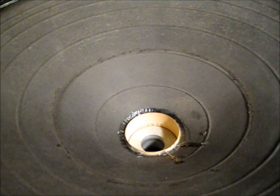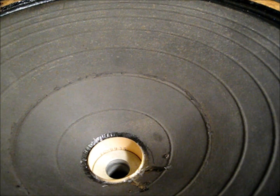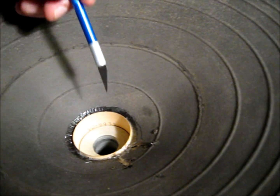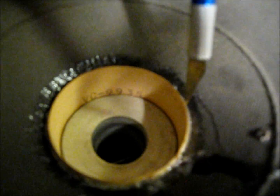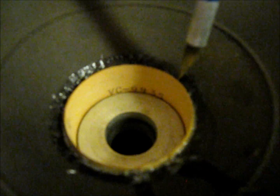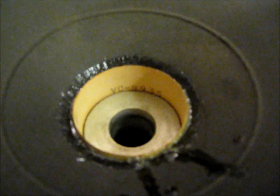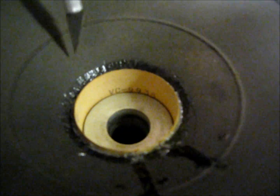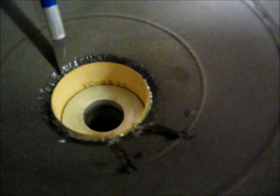and we look down in the voice coil gap, which was another place we were having a big problem here, big rub. And you see I've already re-glued this, but this voice coil had come loose from the cone at least halfway around, and so it wasn't even driving the cone at all. It was just making tremendous amounts of buzzes, along with all kinds of harmonic buzzes on top of it.